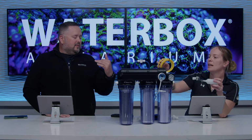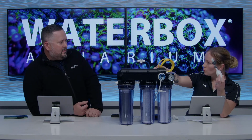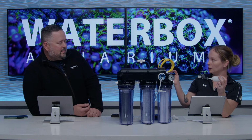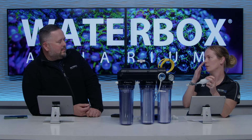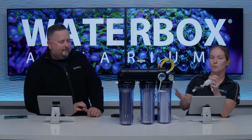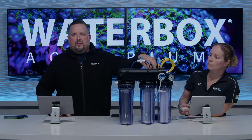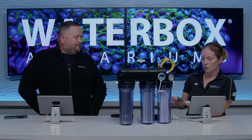Puts a back pressure. Now, if you don't have an auto shut-off box installed on your RO unit, this will not work. It's going to generally cause a higher rate of failure. You want the auto shut-off box because that senses that little bit of back pressure and stops everything. So that's a component that's really necessary, not just a float valve. You can't just throw one of these on a regular RO unit and have it work as well. So auto shut-off is the key. Yeah. Which is a little box back here, which you're not going to be able to see from here, but you can look that up online. Auto shut-off valve. Yep, auto shut-off.